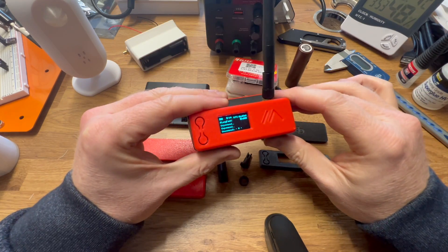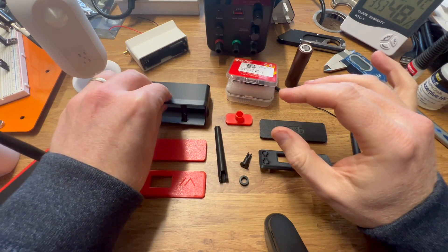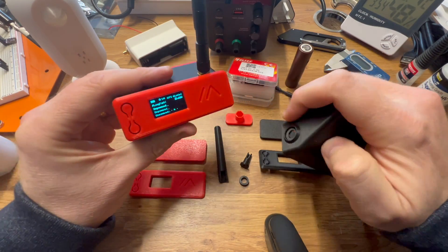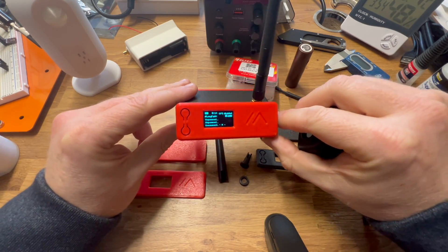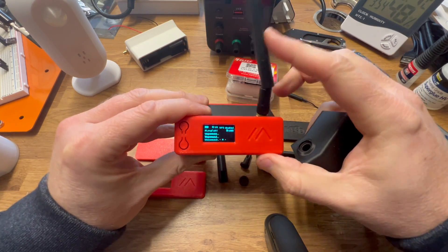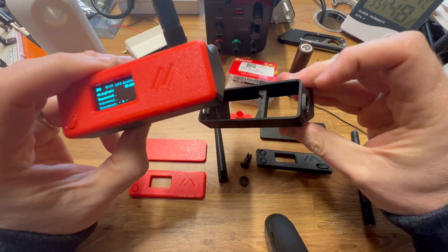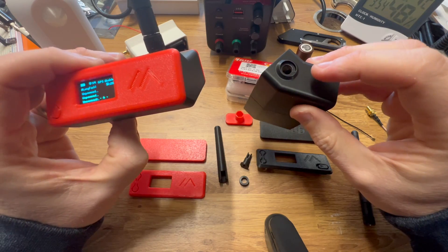The case itself is made up of three main parts. First, you have the main body, which is available in two different versions: one with a top-mounted antenna and one with a side-mounted antenna. The top-mounted antenna is generally better if you're going to have it on a window ledge, desk, or dashboard. It's not ideal for going in your pocket, whereas the side-mounted one — the aerial antenna folds in a better way to fit in your pocket. So this is probably my preference.